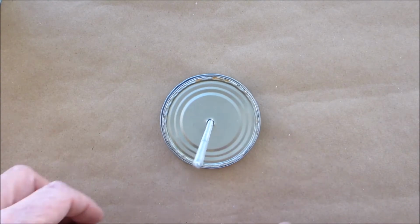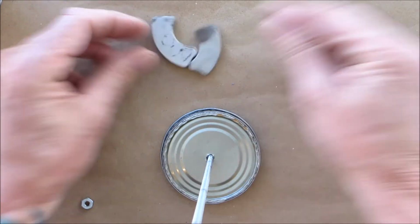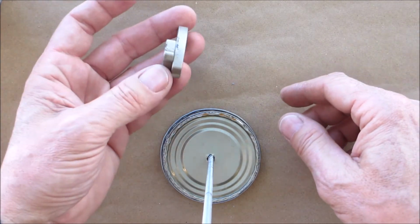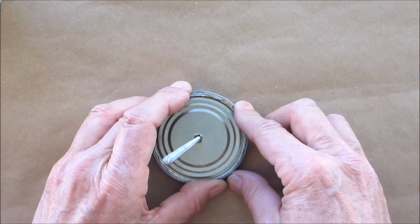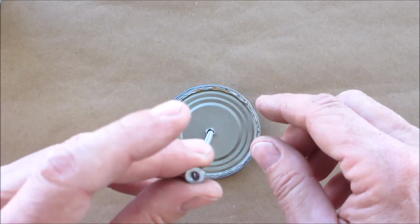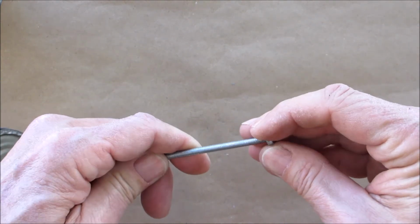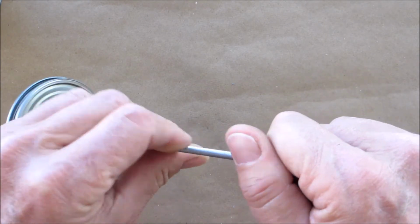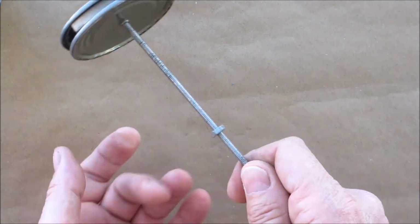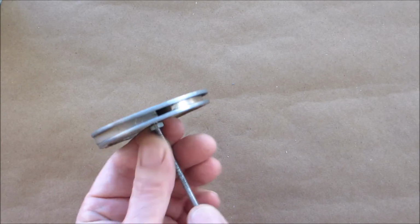And the reason why we put the second one is because they tend to want to jump together, okay? So if you drop this, we don't want them to flip up. We want them to stay flat. So get our second nut, and we want to snug that up.